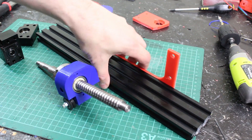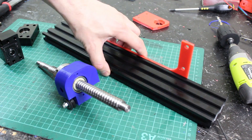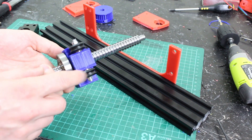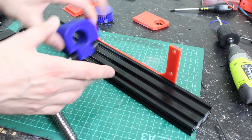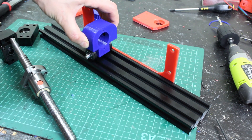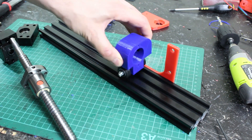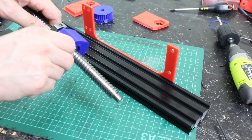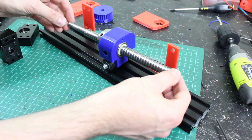All right, I've 3D printed that bracket that holds the motor, and that's attached with some T-nuts into the extrusion. I've 3D printed this part which has got a hole through with the two wheels attached. That should run quite nicely up and down the V-slot. As force pushes those push rods onto this piece, it will be braced against the T-slot. This fits in here and we've got some holes that line up to screw that on. That all looks good so far.